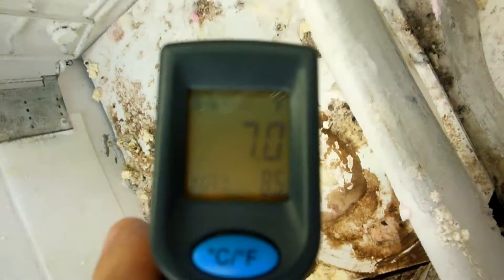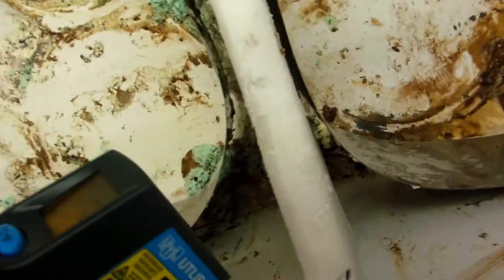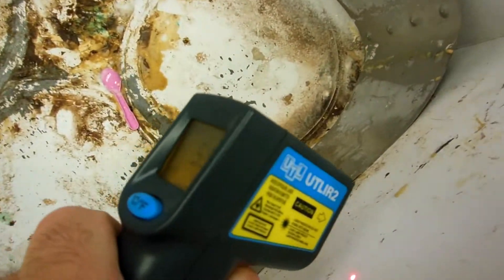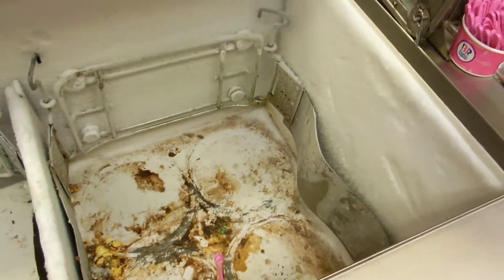So you're about half empty on gas because only half the evaporator is frozen. We've got not-so-good temps over here — just like seven degrees over here and like five over here. So that's how you tell if your dipping cabinet is low on refrigerant. If it's frosty all the way around, then it's not low — if it stops, it is.